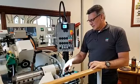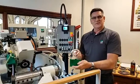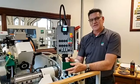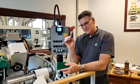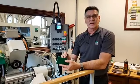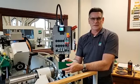So the advent of knocking out these plastic templates is great, but what the byproduct of it that we didn't take into consideration is that this is a more aggressive edge on the plastic templates because of how the templates are made with the little teeny tiny bits in there and the stepping motors and stuff. Sometimes this would act just like a saw edge. So what we noticed is that it was eating up the tracing pins too quickly.